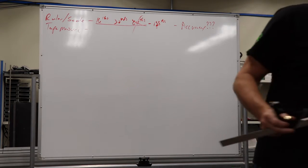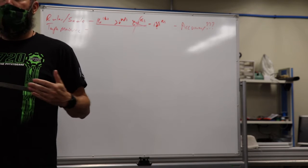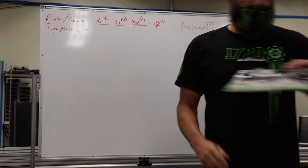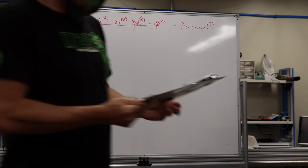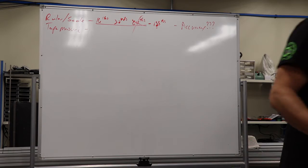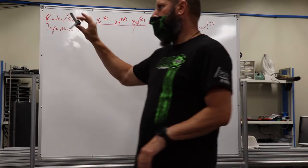It is a square. It's a special type of square. This is what's called a combination square. We use these quite a bit for laying out stuff, and you're going to use something very similar for your first project. So the combination square typically comes as a 3-piece set. What we have is the combination square itself, which is the little square, and then the ruler. Typically, it will also have a protractor head, and then a centering fixture.